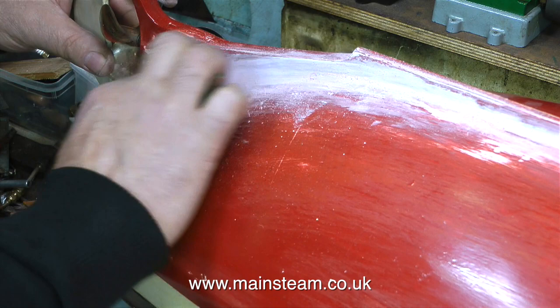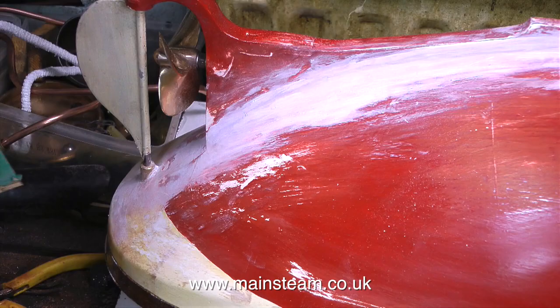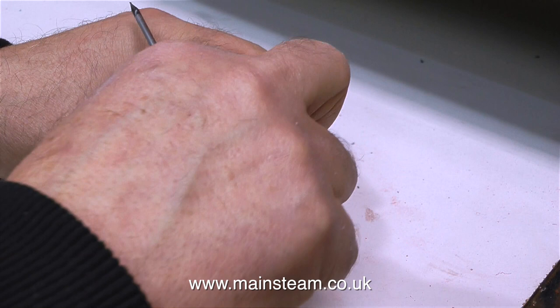This is quite coarse sandpaper. When I rub down the entire hull before I paint it properly, I'm going to be using some wet-to-dry paper — 400 grade should be fine. But before I can continue, I do need the correct colour of paint, so I'm going to try and mix some to match what's already on the hull.